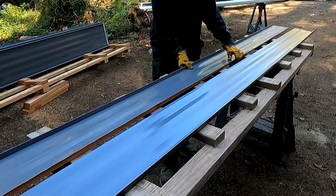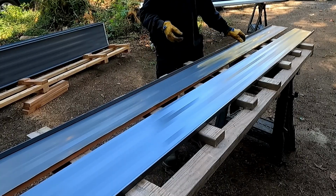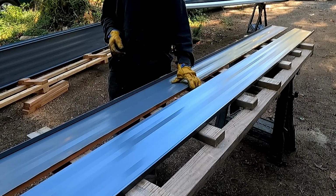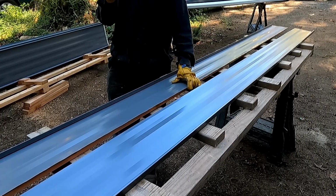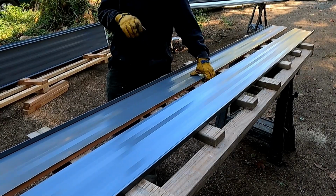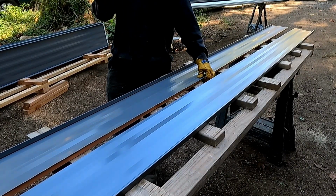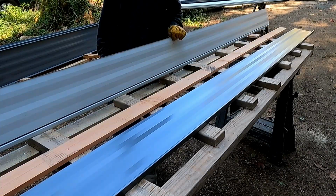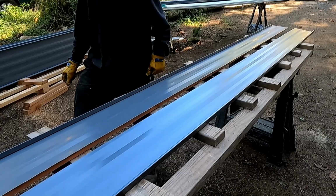This is a cutting table. I don't care if I cut into it, but it was just burning because the blade was backwards. It wasn't clearing chips. And also, unlike wood, the steel minimum tooth engagement does not work very well. So I elevated it on some one-bys here, got some clearance under it, and I could go deeper with the blade, and then it cut nice. So yeah, YouTube is right on this one. I recommend it. Works great.